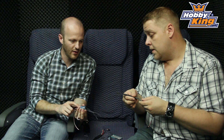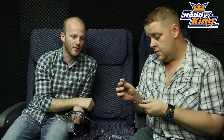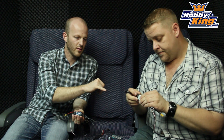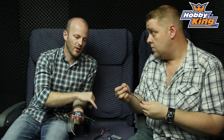We've got 25 amps on there, but really they can go up to 40. The heat sink is pretty small though, so you'd want to put a bigger heat sink on if you want to go above 25. IR MOSFETs — that's an American brand — SMT produced, rated 25 on the sticker but can really go to 40. That's the difference.